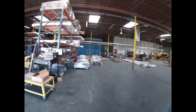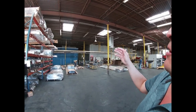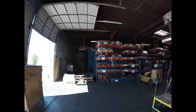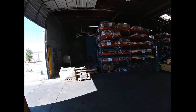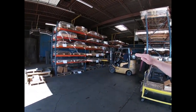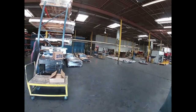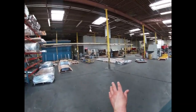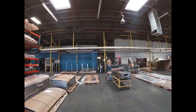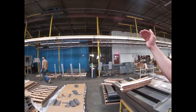Basically what we do, as you can see, we start by hanging parts first. They go through a six-stage washing system, which removes all the dust and oil. Then as the chain moves, it goes through a drying process. Right in the middle we have an oven which dries everything, so as it gets out of the washing system, it goes through the drying process.